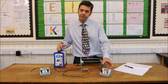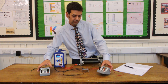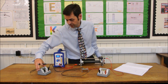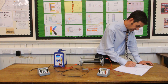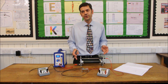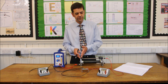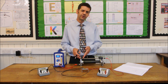You should then have readings on the voltmeter and ammeter which are negative — so we've got minus 2.78 volts and minus 0.29 amps. Then it's the reverse of the procedure we followed before, where we increase the potential difference applied until we get to the fullest travel on the rheostat, reaching the maximum potential difference applied.